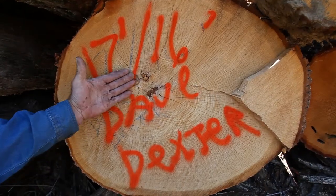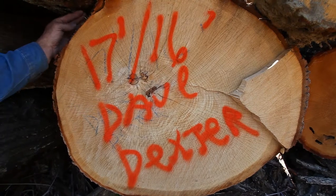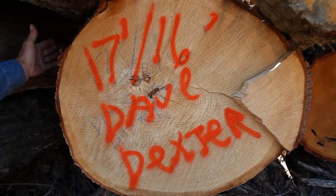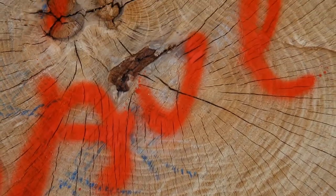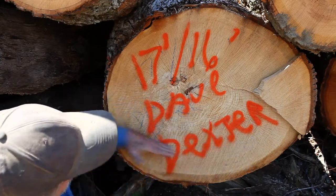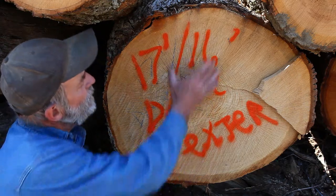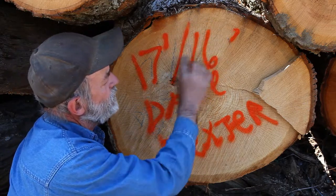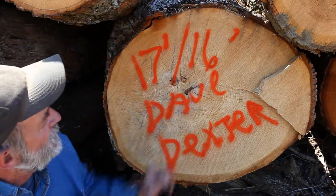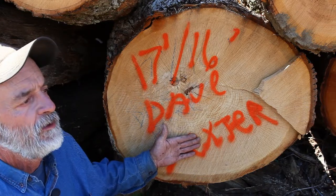This is the small end of the log — the bottom is much bigger in diameter. There's a little knot here because this was cut off just above a large branch, so the log appears to be about 20 feet long but we're only going to use maybe 18 feet, bucking it off on this end. I'm looking to get a very large timber about 14 inches by 8, coming out alongside the heart with the annual rings going through the timber this way. In some position the log will get rolled and I'll take a four-inch swath right down the middle to get quarter-sawn material with annual rings going across — about four inches by twelve — and that's going to be made into floor timbers for the 8-meter.